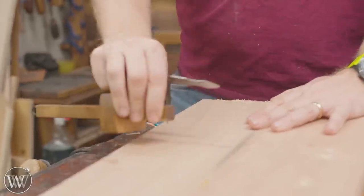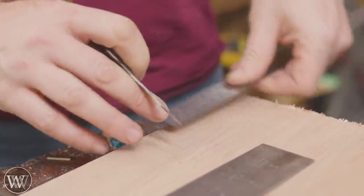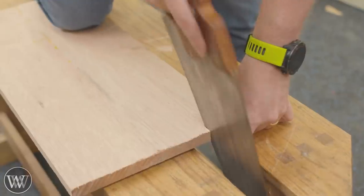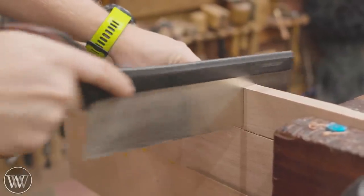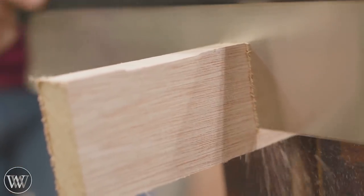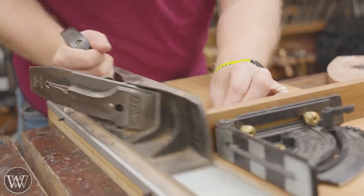We also need to lay out some hooks that will actually hold the flashlight. I was originally thinking about just putting in some dowels for it to hang on, but I thought let's make it a little bit more fancy. So I'm going to be ripping down about a two-inch-wide strip that I will cut these two hooks from. The hooks will then have a tenon that will fit into a mortise in the back of the board. We rip it down and the two pieces come out of this one piece — we cut them in half to make two pieces about the same length, about two inches wide and three-quarter inch thick.